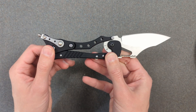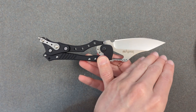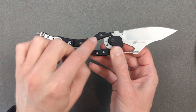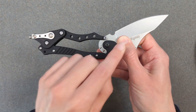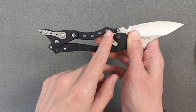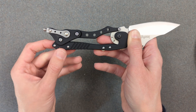There's actually a second place where this is acting as a toggle, and it's actually in the opposite direction — and it's what makes this lock. When we're talking about opening, it's the spring tension pushing on this lever bar into this pivot. But when we're talking about locking, we're talking about force against the blade spine pushing on this lever bar into this pivot. When you apply negative force to the spine of the blade, it's going to try to rotate the blade closed. But because this is attached to this lever bar, it's going to try to put a leftward force against it. As we rotate this closed, this is moving to the left — and just like before, there's an inflection point right about here. Right about here, the force from this bar is pushing directly into this pivot point — that's the inflection point. Anywhere above this, it's going to want to close the knife.